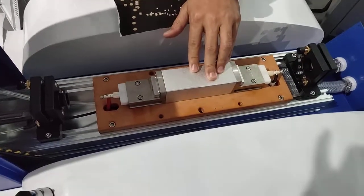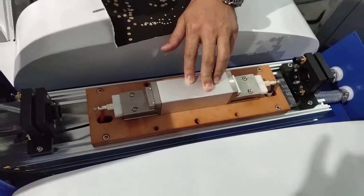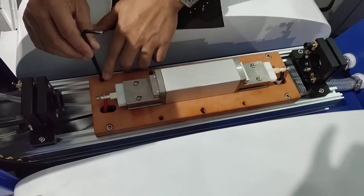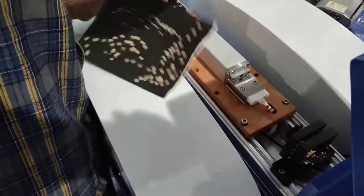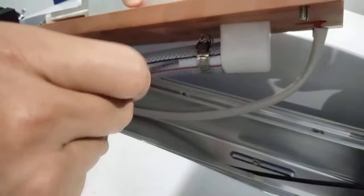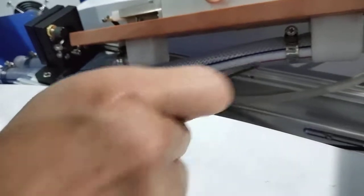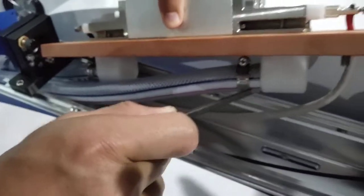Step one: you need to power off the machine and make sure the electronics is off. You need to take off these four screws and move this housing — the YAG housing. After taking off this housing, sometimes you need to make sure the water pipe connecting should be 100% waterproof. So you route this lock and add some waterproof tape.